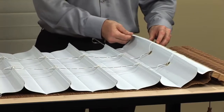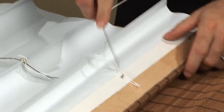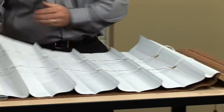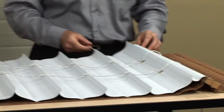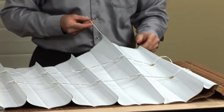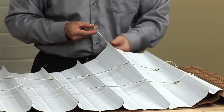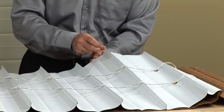The Self-Operating Liner and uncorded cord shield are stapled to the wood head rail. Note, the tabs of the liner are facing outward. Once this is done, the rib rods can be inserted into the liner tabs. Start with the tab below the grommets, then insert the rib rods into the remaining tabs.